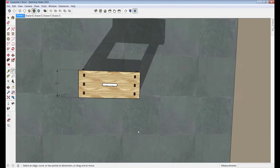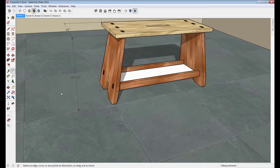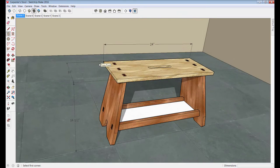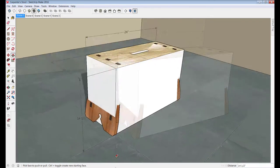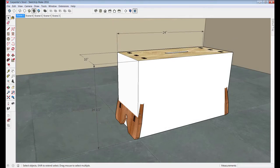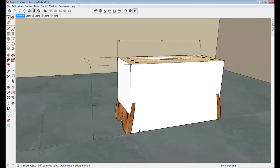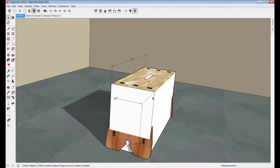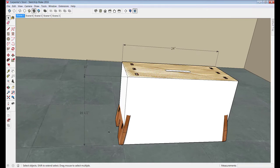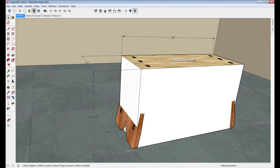The primary feature of a good footstool is that the footprint is larger than the dimensions of the top. If we draw a rectangle on this top surface and stretch it down to the ground, you can see that the legs of the stool stick out beyond the end of the top. I've got it set at about three-quarters of an inch, and the width of the legs where they sit on the floor is wider than the width of the top — having the footprint larger than the size of the top is what gives the stool stability.